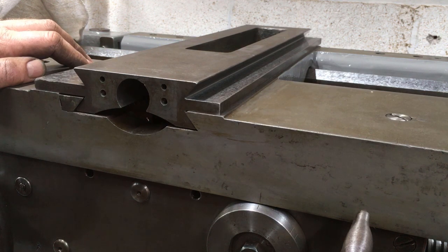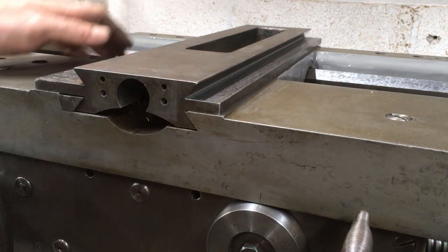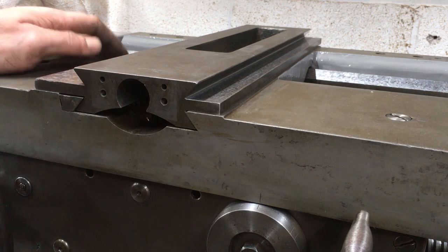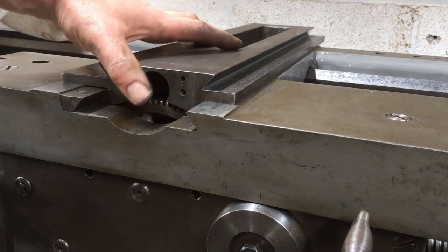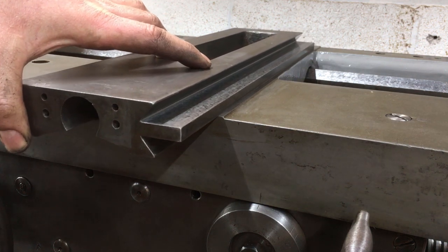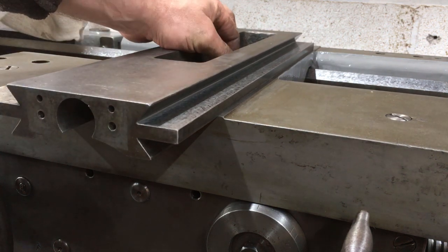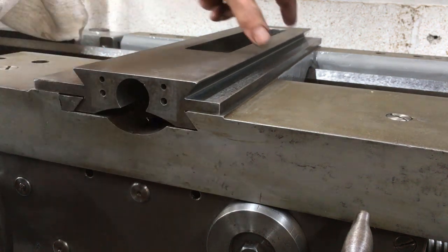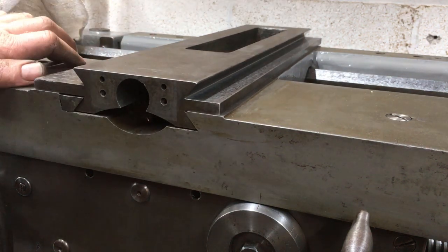Now I have been doing the whole face all the way along, the reason being I printed it first off the granite plate. Now when you consider that it's only actually moving from there to there, I think it's about 4 inches of movement, I could get away with just hollowing out the mid sections now. Anyway, enough of me babbling on. I'll go and find my blue ink.